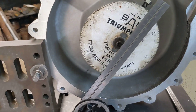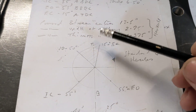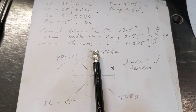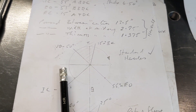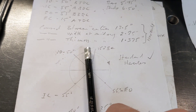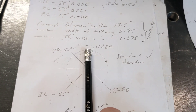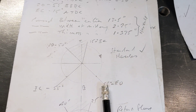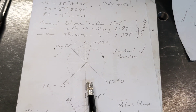What we needed to do was get back to the standard Bristol Hercules valve timing. This is the valve timing of the Hercules — it's a four-stroke engine. Starting on compression, we come around to bottom dead centre, then the exhaust cycle, then induction, then compression again. Starting on compression: once we have ignition of the mixture, we've got the power stroke, and the exhaust valve opens at 55 degrees before bottom dead centre. This information I have from the Bristol manuals.